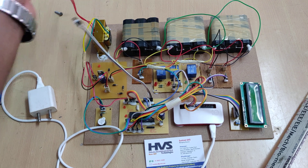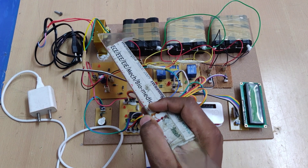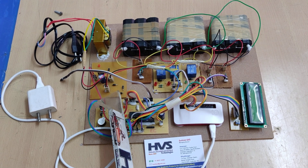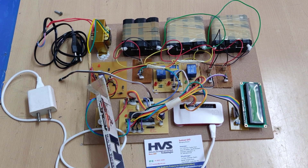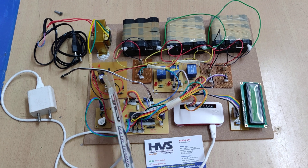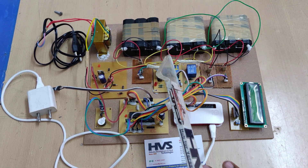The charging voltage comes from a transformer used for step-down purposes — it steps down the mains AC to 12 volts AC. The power supply board has three stages: rectification using four diodes to convert AC to DC, smoothing using a capacitor for smooth DC, and then regulation to get 5 volts DC. The 12 volts DC is also supplied to each battery through its corresponding relay.